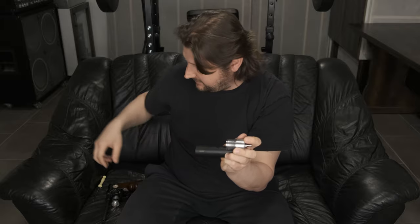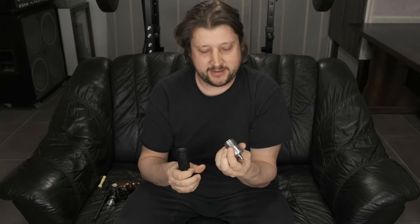And if you screw this in, now the diameter from here on is smaller, but still there is a lot of additional air here that would not be with the original end cap. So with making a part like this, this is very critical. Any of you that wants to build something like that on your own, this is a high pressure part, of course, and this not only has to be done correctly and tested properly, it has to also be made out of proper material. So this is actually aluminum 7075, one of the most durable aluminums for these purposes, and the tolerances are extremely tight of threading it in, and the thickness of that wall is still 3.5 millimeters, as well as the front wall, so it's more than enough to withstand the pressure.